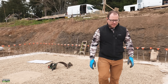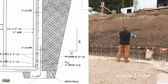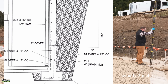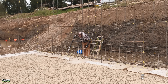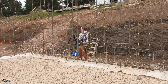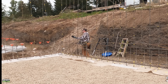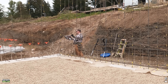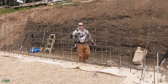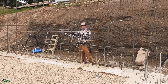I'm going to go ahead and drop all those verts in now. These verts have to be three inches away from the inside of my concrete. So as the viewer, if you were to touch the foundation wall, three inches in — that's where the steel's at. Those verts that are already precast, same thing from the opposite side. This mat is 12 by 12 and it's on the tension side of the face. Imagine that the hill of dirt sloughs right into the wall — as the wall stretches toward the camera, that's the tension side.